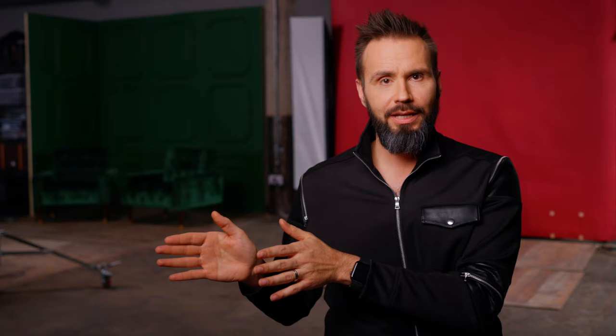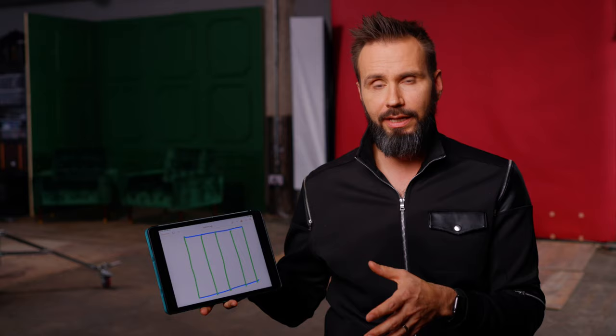All the lumber pieces were 2x2 inches by 8 feet — though in our lumber system those 2x2s are actually 1.5 inch by 1.5 inch by 8 feet, or about 4 centimeters by 4 centimeters by 2.4 meters. Because I was using three 4x8 foot wall panels — one on the small side and two on the square side — I wanted to create an 8x8 foot frame for one and a 4x8 foot frame for the smaller wall. To do that I came up with a schematic to make as few cuts as possible, using whole uncut pieces of lumber for the blue lines in my plan.